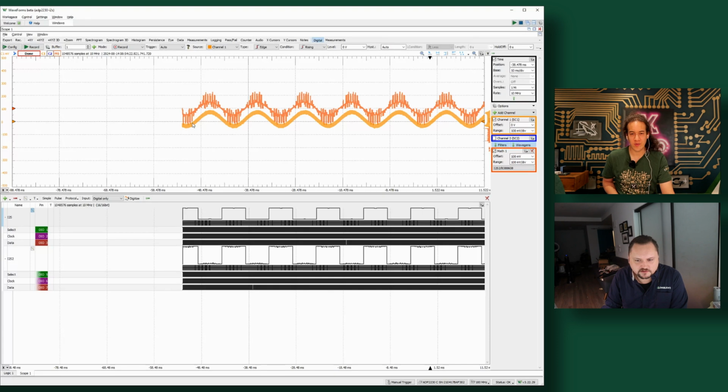And I guess there's no way you could do that with the AD3. You can capture it in small pieces. If you know what you're looking for, you can set very specific triggers to find the bug. But when you're working with a small buffer, you really need to know what you're looking for in a longer sequence like that, as opposed to capturing everything and searching for it later. Nice.